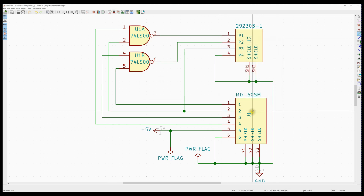The second issue in this layout is that I've dropped these two NAND gates on here but I haven't powered them — I've got no power being brought to them. I'm surprised the electrical rules check isn't flagging that. We need to actually get power to these, and we do that by going into symbols.